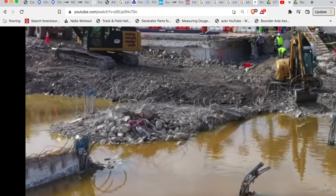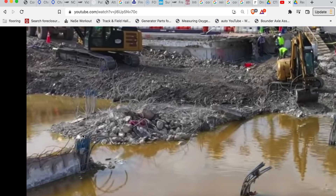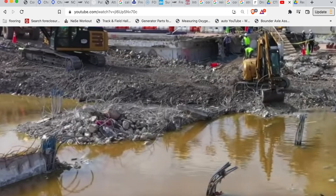This video shows the end of the driveway ramp coming into the structure. This is M, and you can see the reinforcement on M is not buckled. In fact, they removed the concrete from around it already and it's still straight rebar. You can see this is the demoed part of the building, it's turned over like that. You can look up here - look for K and you'll find K standing there proud. So we don't have K as a buckled item.